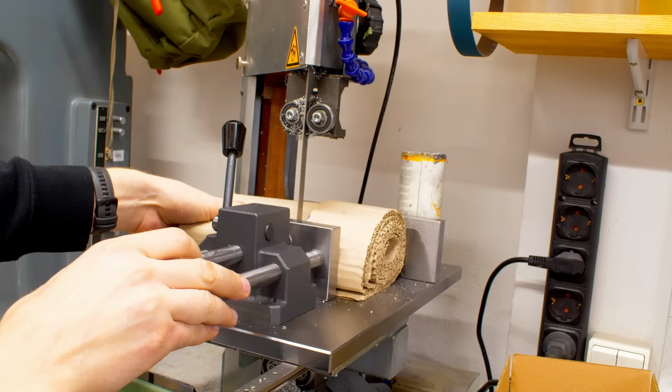I don't have a good tool for that, so I reached out to a friend who has a wire EDM in his barn. I'm preparing a bunch of blanks, 40 millimeters long. He's going to wire the bores into them a few micron undersize so I can grind them on a lathe to final ID using a high-speed spindle. Then using the CNC I will do the 3D grinding of the lead-in radius, and then we will do some polishing. So basically not very complicated, but first we need to cut the blank into 40 millimeter lengths.